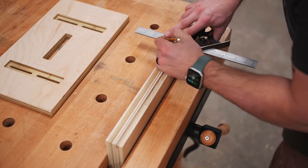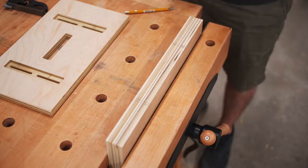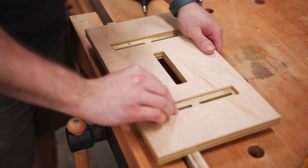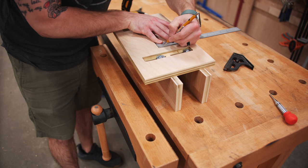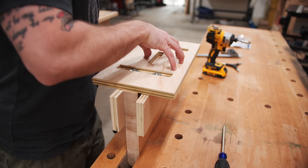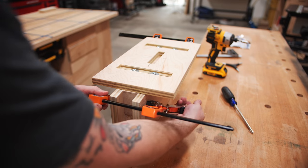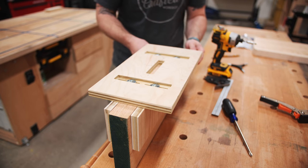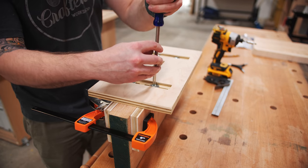After cutting, I cleaned up the piece off camera and then marked hole locations that matched up with the slots I cut on the template on a few scraps of plywood, and these would make up the new side supports. I drilled holes in these locations over the drill press, threaded in some threaded inserts into the holes, and finally I could attach the template top to the side supports after grabbing some longer bolts. I also marked out some center lines on the jig. Those mounting slots make it really simple to center the jig on whatever material I'm working with just by lining up the center line on the jig with the center line on the piece. The beauty is I can quickly readjust the jig to work on a thicker or thinner piece if needed, and it makes me want to make more adjustable jigs like this in the future so that they aren't just one-time use jigs for one project.